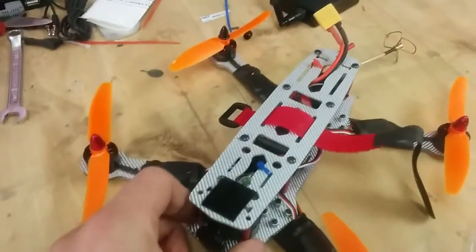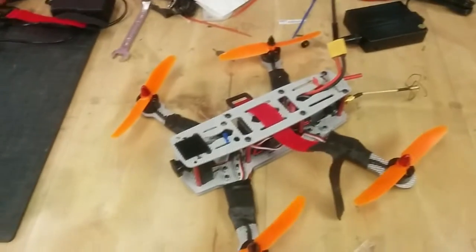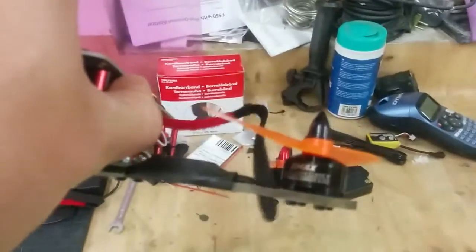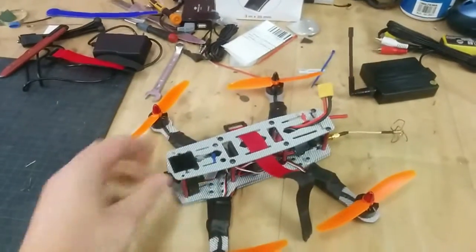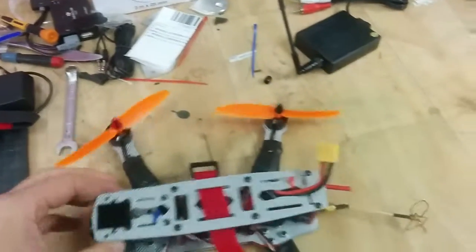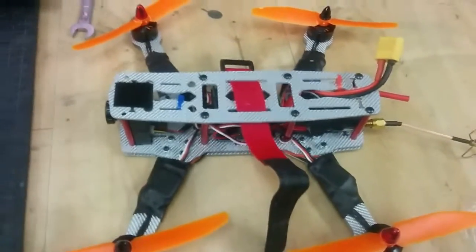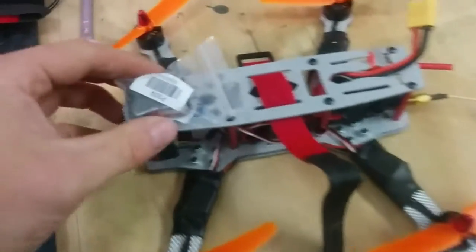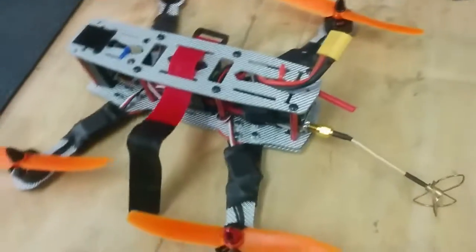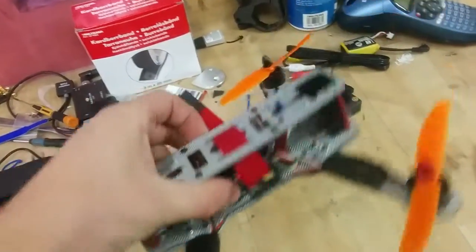This was one of the white carbon fiber-like frames. I'm not sure if this one is carbon fiber — I don't think so. This one should be glass fiber. It's a little bit heavy, but it flies really good. Running Emax 2280KV motors with 5.4 props, some really heavy camera at the head. I have a beeper lost finder, 400mW 5.8GHz transmitter. I usually run this with a meter on top that shows battery voltage and alarms. It's a really nice flying quad, running with MultiWii. It's only held with double-sided tape — not that good, but it works.